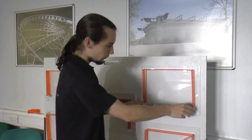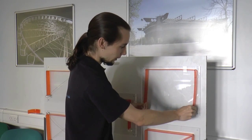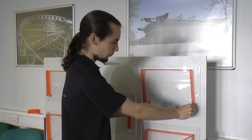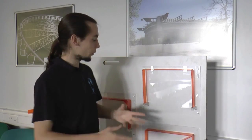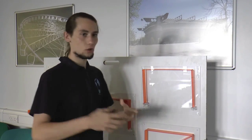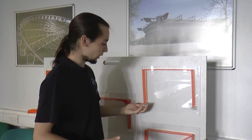Now, what we've got at the supports are pin connections, so they're allowing rotation when we apply a force to them. We're doing that because of the cross section of the bench itself, which is that very thin sheet metal, which isn't going to actually provide a lot of moment resistance. It might provide a bit, but when we come to model things, we want to make things as simple and easy to analyze as possible. So we're going to simplify it to pin connections, which is conservative, but it's not going to be too far off.